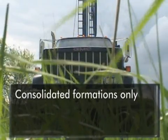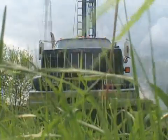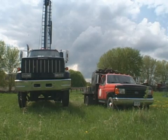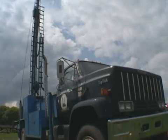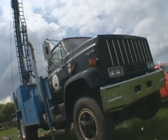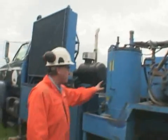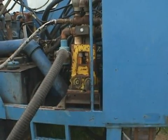The air rotary drilling system is primarily designed for drilling in consolidated formations, offering good penetration rates and quick cuttings removal. This system usually consists of a truck-mounted drill and a separate support vehicle carrying supplies such as water and welding equipment. If horsepower requirements are similar, one engine can be used for both via a transfer case. The rig's equipment includes an air compressor and both water and mud pumps to facilitate the removal of cuttings depending on the geology encountered.